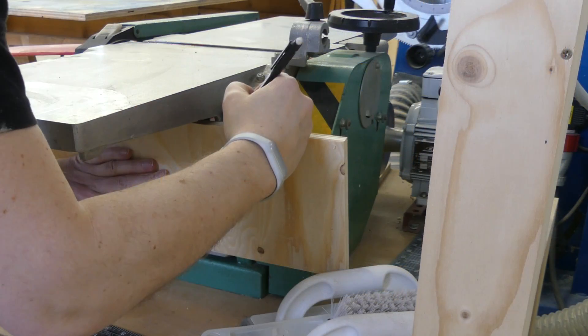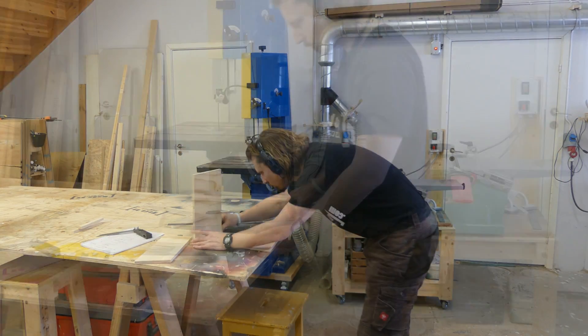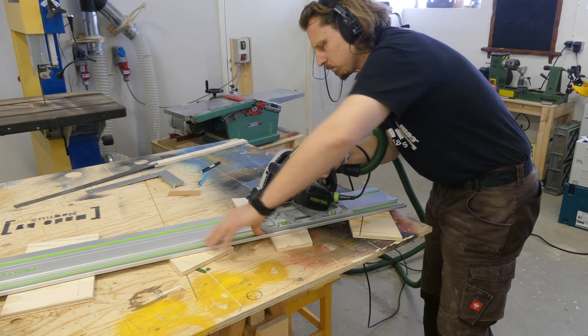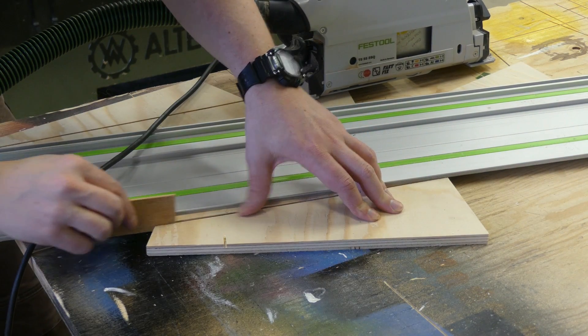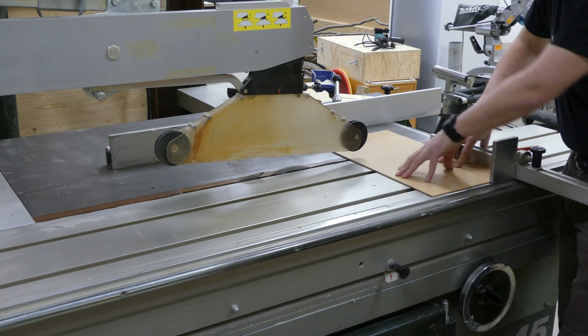To get the length of the piece for the front I just held it in place and made a mark. It was a lot of going back and forth to figure out the next step, but I wanted a slope on the bottom and measured onto the sides where to cut the dados. These dados were then cut with the track saw and I used a small test piece to make sure that the bottom would fit. Then it was just cut the masonite for the bottom to size.